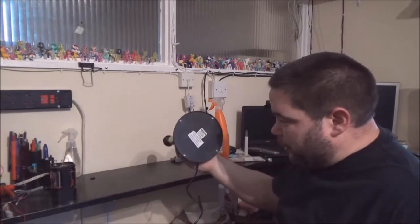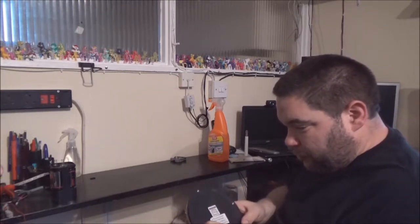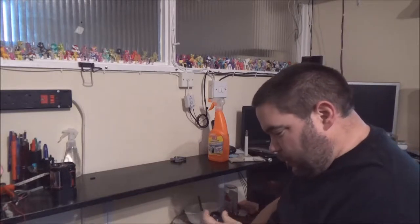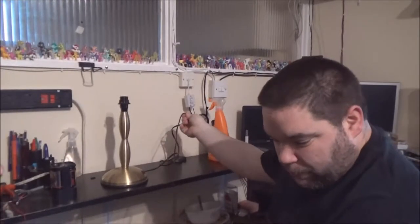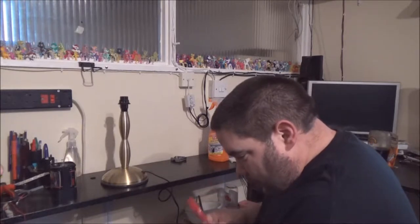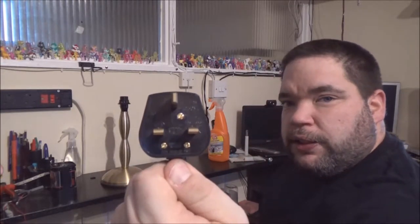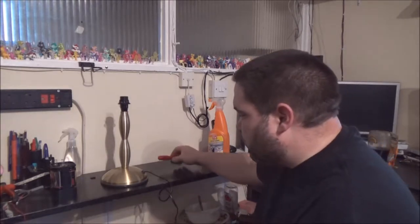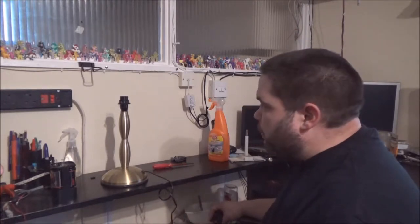What you would basically do is take a lamp like this, make sure it's not damaged. All four screws are still present, there's nothing loose, that's all okay, lamp holder's not damaged. Then you would just check the flex visually and run your fingers along it just to make sure it's not damaged — we're okay there. I'm not even going to bother opening the plug simply because there's a tamper sticker still over it that hasn't been damaged. Let's check the plug, make sure that isn't damaged. I will get a bulb and put in there just to make sure it does work.